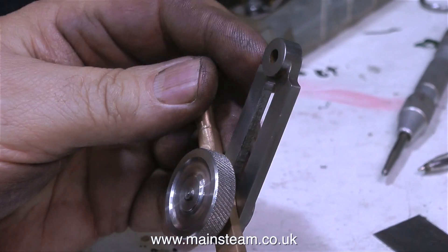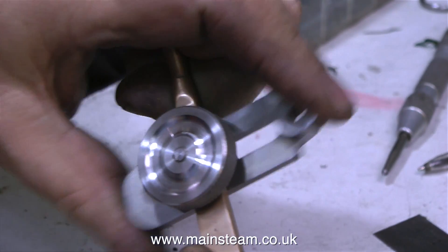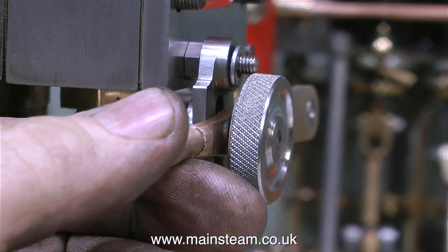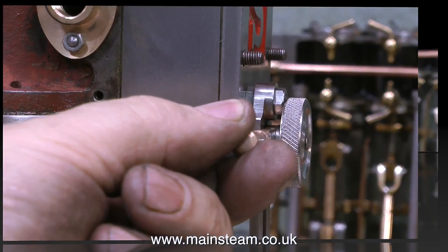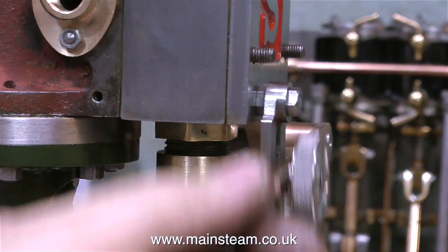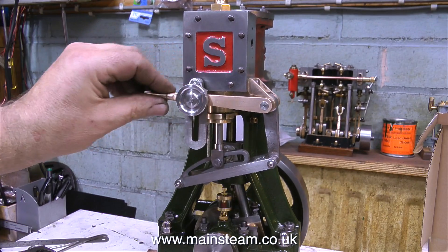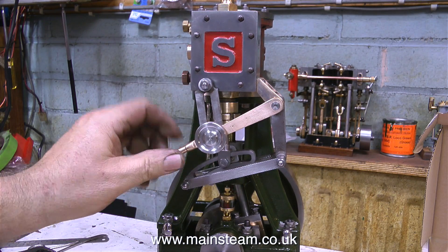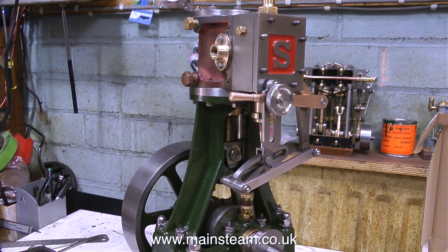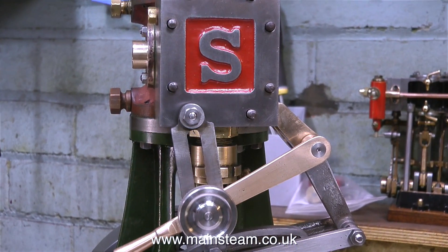It's now nine o'clock in the morning and two hours after starting I've nearly finished editing the video. Once I've uploaded it to YouTube, I think I'll have a quick trip to Black Gates and see what kind of wheels they sell off the shelf. As I'm not using the original design of locking lever as shown on the drawing, the extended stud that holds the anchor link gets in the way of the new handwheel - but this was a very easy fix. I just shortened the stud slightly and turned down two 2BA nuts. Now the reversing lever can run in the slot the full length of the anchor link. If anything, I think my reversing lever lock is a little bit on the big side - my hands are also a little bit on the big side. If I was going to use this 5A in a steam launch I would keep this handwheel, but I think I'll either turn up a smaller one or see what Black Gates have to offer.